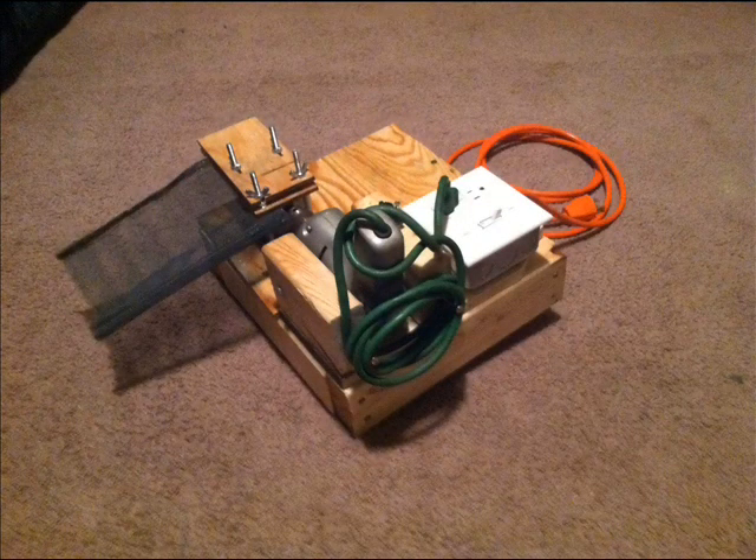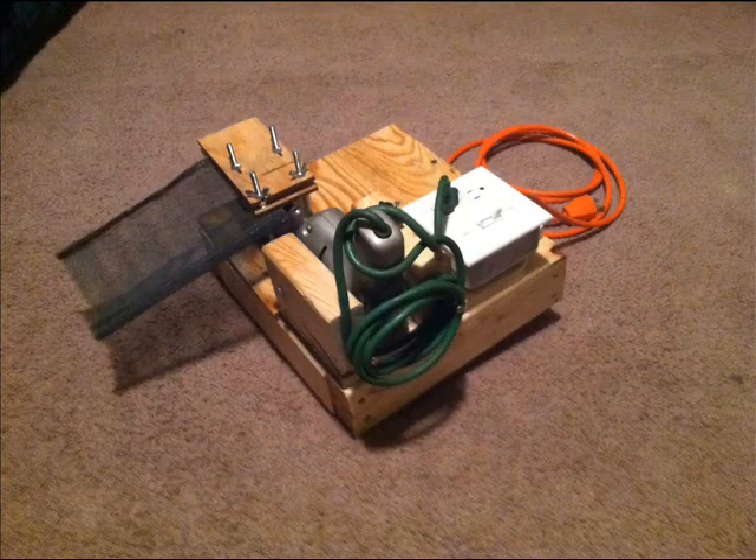As for the power, I made a little cord with a dimmer switch and an outlet, which is easily removable — just held in by a couple of screws. I plug the drill into that and have the drill in its locked-on position, and I can slow it down however much I want. It cuts better and doesn't throw oil as much if you have it flat. The green cord from the drill is done up on part of what's holding the underside of the drill up to keep it from moving — that's just a block of wood screwed through the bottom, and it's also got bolts on the sides so the drill won't go any other direction.